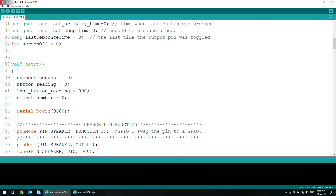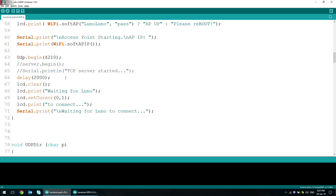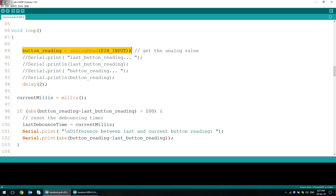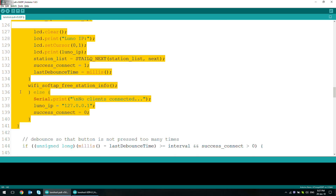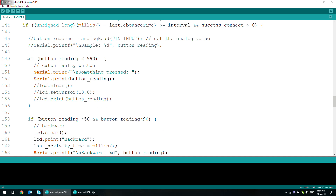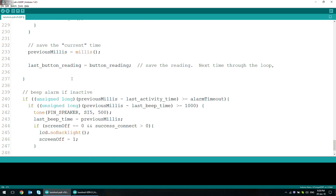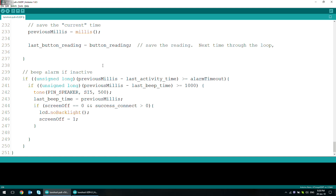Let's look at the code. This is the remote control code. First we initialize the access point and open the UDP port. This function sends a specified character through UDP. In the loop function we continuously monitor the analog pin to understand what button has been pressed. This is a debouncing code to avoid probing too often. If there are no Wi-Fi clients connected, the loop function won't execute anything else. Once debounce has passed, this code decides which button was pressed based on the voltage detected on the analog pin. Finally, at the end is the beeper function — if you leave the remote without any action for some time, it turns off the display and starts beeping to attract attention.